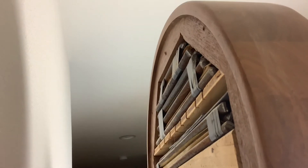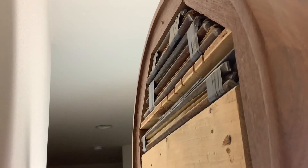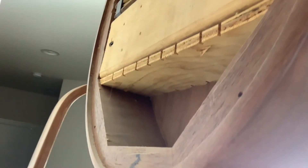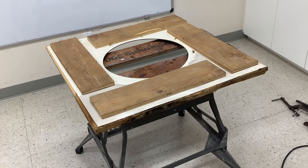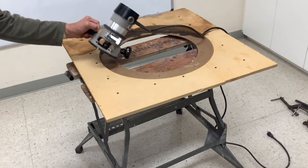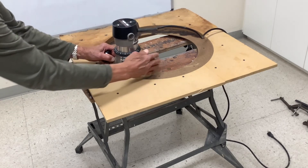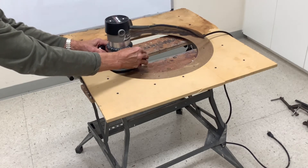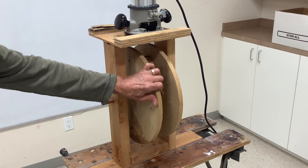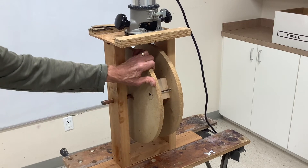The weight wheels are constructed to minimize exposed end grain and to make the glue joints thin and tight. Eight mitered pieces of two by three and three-quarter inch walnut stock were glued together to form an octagon about 17 inches across. Three of these were used to make the first three weight wheels. Two by two inch stock was used to make two more octagons for the paper pendulum wheels. The lathe was not large enough to turn these octagons into cylinders, so I made some templates and jigs so a router could be used. These have water stains and rot after spending about 20 years in the crawl space. The first template mated with the sides of the octagon and guided the router to make a 15-inch diameter hole in the side of the octagon, about 5/16 inch deep, so a one-quarter inch plywood disc could be inserted to make the side of the wheels. These octagons were then shaped into cylinders using a jig that held the router while the octagon was rotated under the router bit.